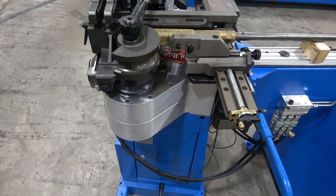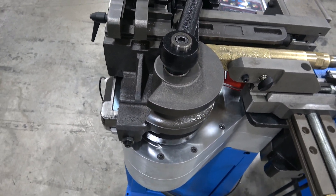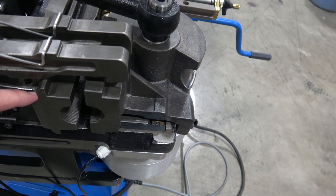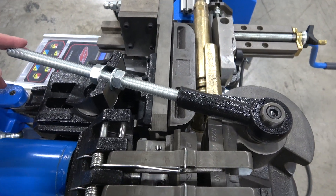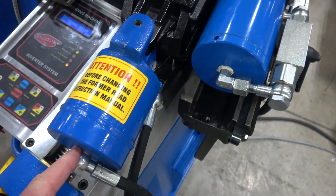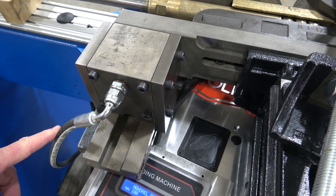Looking at the top of the machine — this is the back side. This is an adjustment for the wiper die. It's the center former, which is what the tube's going to wrap around and controls the radius. You've got your clamp die, your clamping fingers — this is also hydraulic, part of the hydraulic reservoir system. You've got a clamp die switch we'll talk about how to set. You've got a tie bar — you should always have that on; it gives you a better bend and more consistency. And you've got a clamp cylinder, which is your pressure die cylinder, and a pressure die lock that keeps the pressure die from pushing back during a bend cycle.